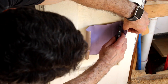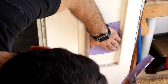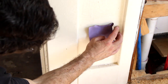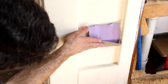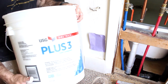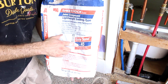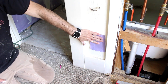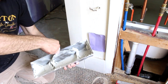What you want to do now is simply trim your paper to size. You can peel back the paper and apply joint compound on the edges — apply joint compound underneath where the paper is located. I'm going to be using premixed joint compound. This is Plus 3 premixed. This other one is setting type joint compound — EasySand 45 — it'll set up within 30 to 45 minutes depending on temperature and humidity. So if you want multiple coats and want this to be a one-day project, use setting type joint compound. But for today, I'm just using the premixed version.